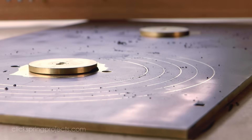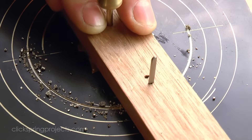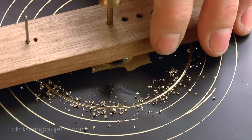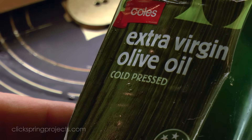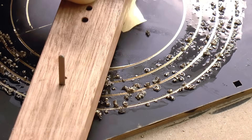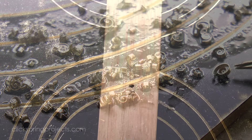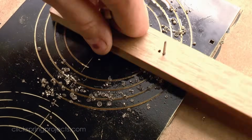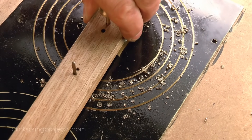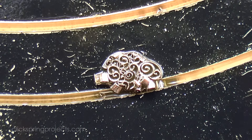So with the layout complete and the tool geometry confirmed, the cutting can begin, and it becomes immediately apparent that this is a very effective cutting tool. Three or four passes establishes the cut, and once established it's essentially self-guiding to the bottom. I found a small increase in performance by using olive oil as a cutting fluid, and I think its main contribution was to lubricate the sides of the groove as the slot deepened. With care, the cut radius can be kept inside a tenth of a millimetre tolerance on the arc, and importantly the tool doesn't require any particular skill to operate — certainly nothing like that required to control a file or a saw along such a precise path. And perhaps the sweetest sight a metalworker from any era could wish to see when testing a tool would be this: a collection of bright, tightly curled chips, showing a uniform depth of cut, and even a natural tendency to chip break as the slot depth increases.